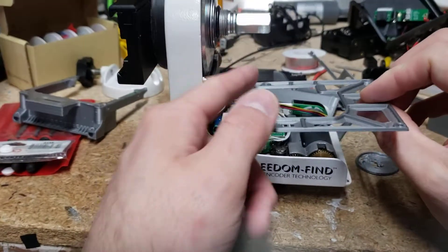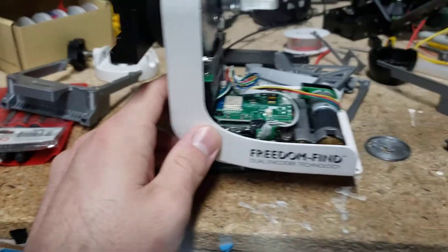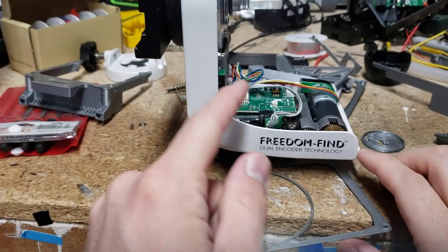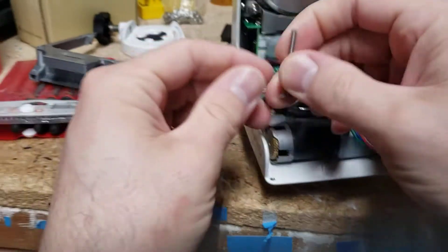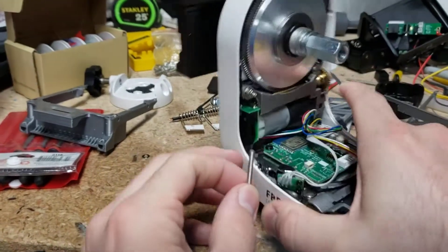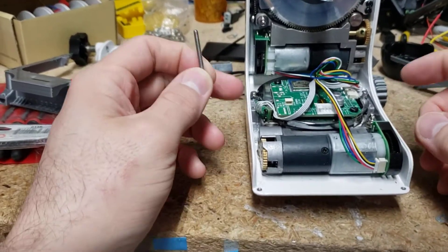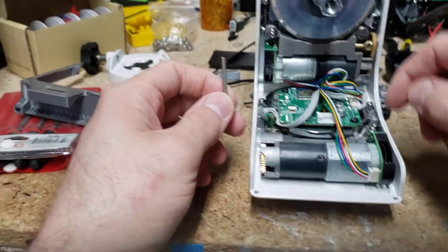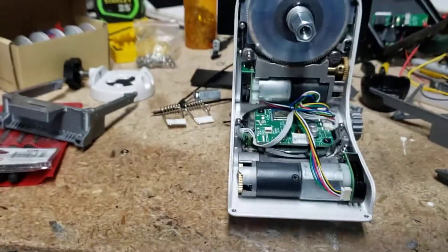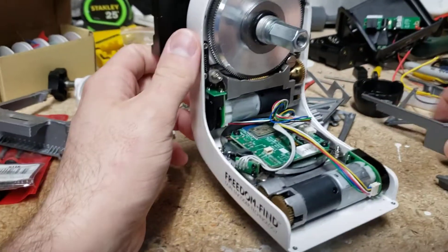I made these other pieces and had to bend them and cut where I made mistakes or they didn't fit. I went through all these pieces. I think this one goes underneath — that's how I figured out the screw hole distance. These screw holes up here are actually slanted, so on the outside it's all the way towards the edge of the wall, but when you get in here it's moved over — it's tilted like a good 10 degrees. Those were tricky to find. You can't really get the calipers in there to measure, so you just have to make a model, slap it in there, see if it works, measure it, change it a little bit, print it again, and come check it. Just did that a few times.